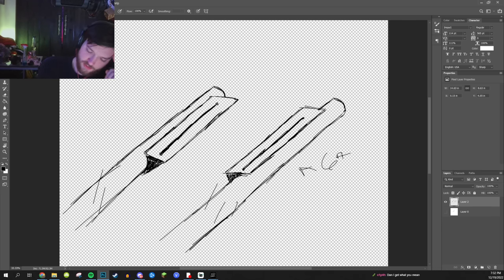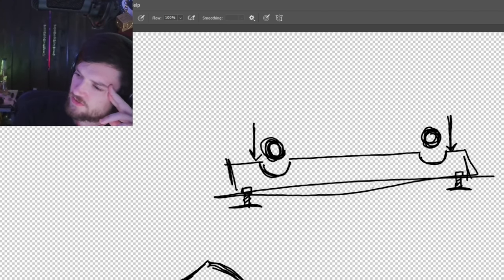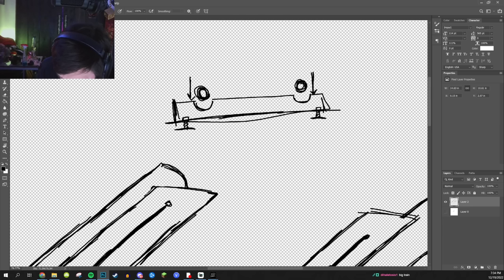Then the two pipes, the two tubes, will have to be connected for rigidity. So I have square tubing as well. Take a piece of square tubing like this, and then I'll cut two troughs out like that. The two frame rails can sit in that trough, right? Let's say that the floor I put it on isn't level, so that'll all be adjustable, and I can screw these up and down. Does that make any sense to you guys? I'll do this for the front and the back.